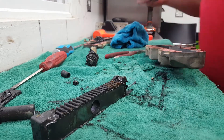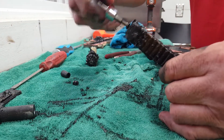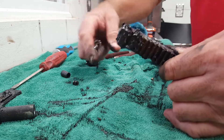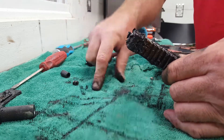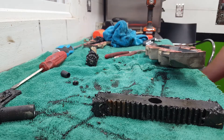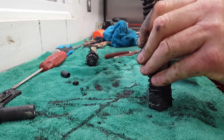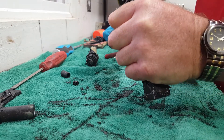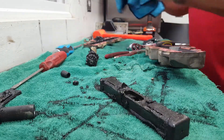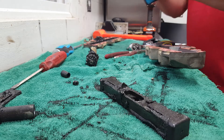What I don't like is the fact that on these particular gearboxes, that screw has backed out. There's the bushing that drops off the end of that gear, and when that gear falls it strips — and when it strips, that's a ruined gearbox. That screw won't tighten nor loosen, so we're going to have to cut it out. We'll put the video on pause, get these things cleaned up, and be back in a few.